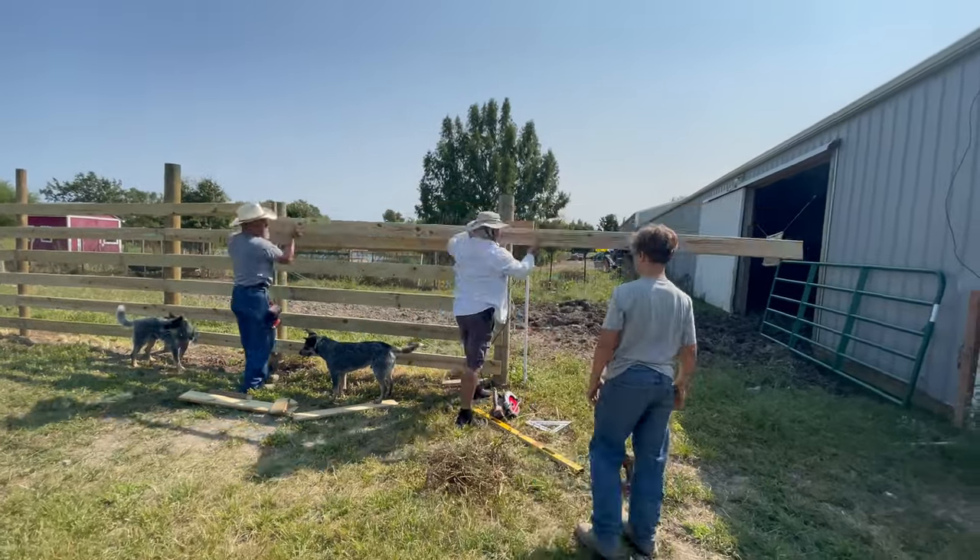Using a paddle bit here — kind of dinged it up on a screw. He's drilling a little bit slower. Putting the bottom hinge on the bottom pin, grab the top bracket, slide it up — it should be about level already. Give it a little tighten, then check swing and clearance.